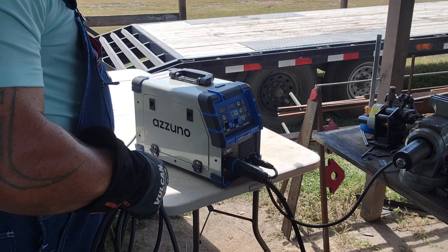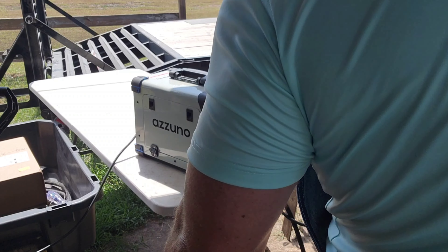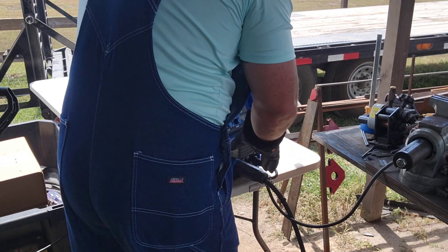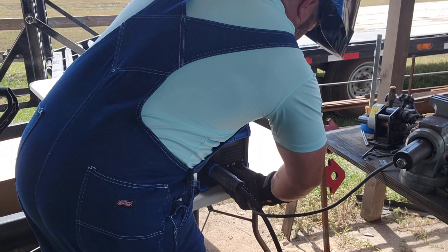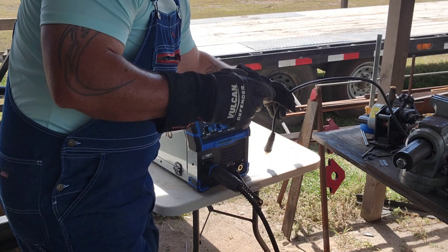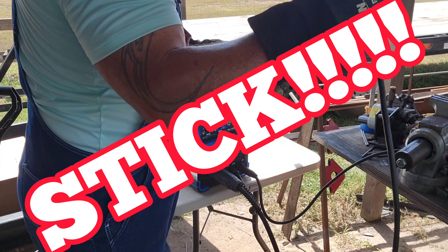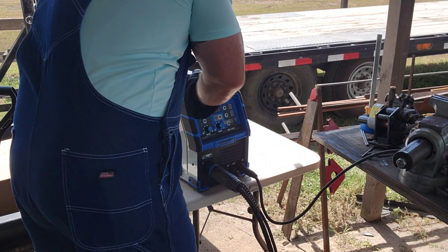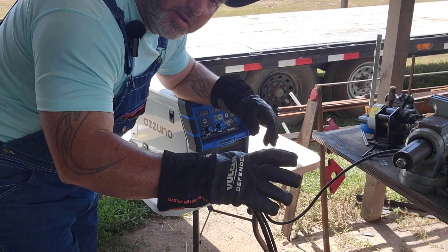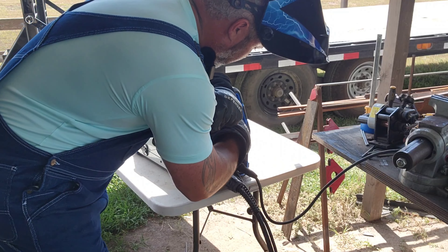It's a good weld — doing its job, penetrating, strong weld. Let me get a couple 7018 rods and walk you through how we switch this out. Number one thing — make sure you cut the machine off. It does have a little bit of delay, a cool-down time with that fan. When it shuts off, take your ground off this little loop right here. Take your wire weld stinger out and just let it hang. Take your ground and plug it in the stick ground port. Take your stinger for stick weld and plug it in the positive. Turn the machine on and — most important part, don't forget — come up here and change it to MMA. That's your stick weld. Push the button twice — you're on MMA.